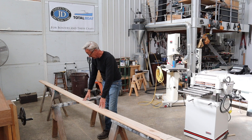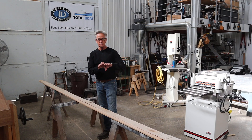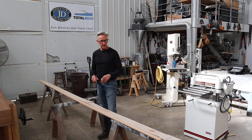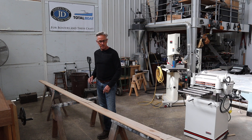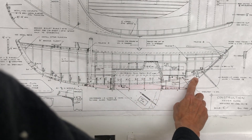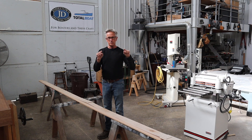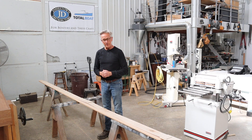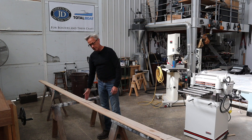When laying out this spiling batten on my plank, there's a definite dogleg in the batten, so the plank is going to be slightly curved. The longest stock I had was 16 feet, and I'm just a few inches shy of making that 16 feet. I knew this would happen — from the garboard, the planks are slowly going to get longer and longer as the transom shoots out and the stem goes up. So I was hoping to get by with a single plank on this first broad strake, but it looks like I'm going to need to make a scarf joint.